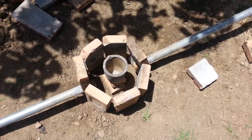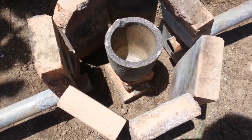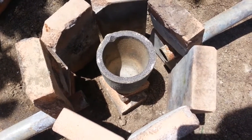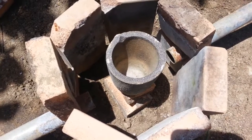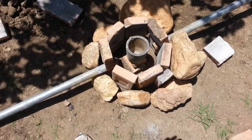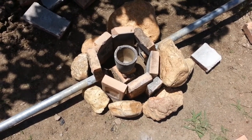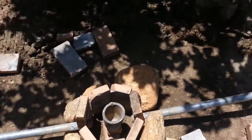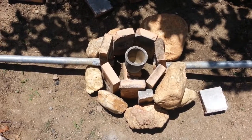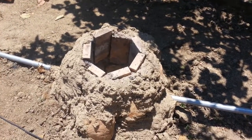The two support bricks eventually broke, which meant the whole furnace didn't work — hence why I'm making a new one. Maybe a problem will be that the bottom of the furnace will have coal that won't burn because there's no air going to it, but I don't think that'll be an issue because we're not heating from the bottom up, we're heating from the side. So we're starting off by adding some rocks to the side to give the wall a nice thickness, since we're sealing it with mud — we ran out of heat-resistant cement. This is the sixth version of my furnace.